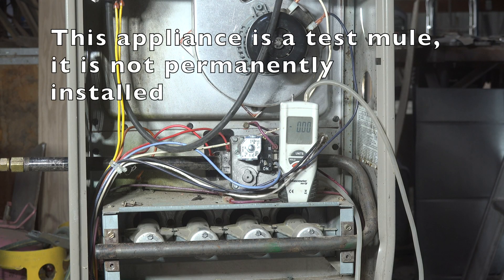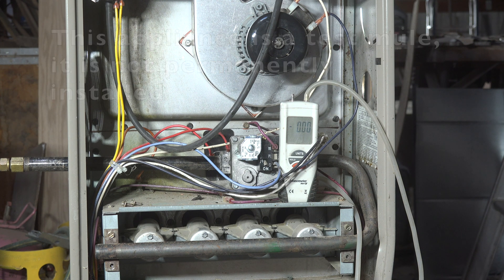I was asked by one of my viewers whether a gas valve will work when it's installed backwards. If it was a pilot valve it's a different ballgame, but for this type of furnace that gas valve right there is not a flame safety device — it's simply a redundant solenoid and a regulator valve. It regulates the pressure and turns on the gas, but there's no flame safety component in it.